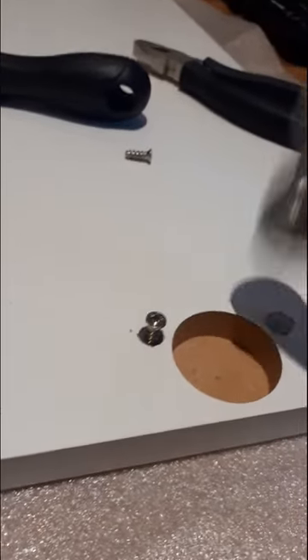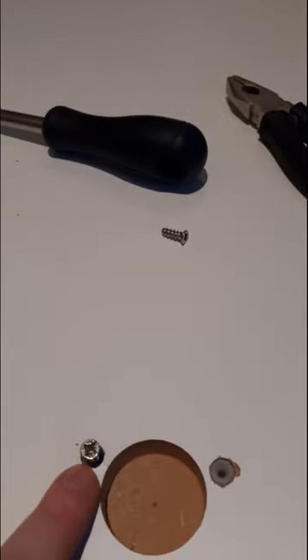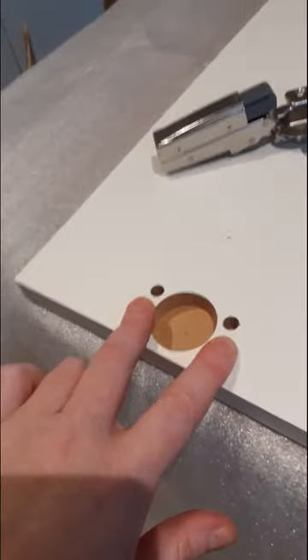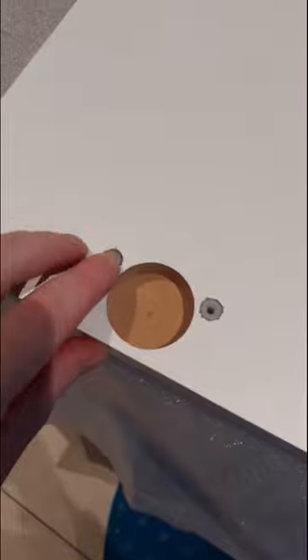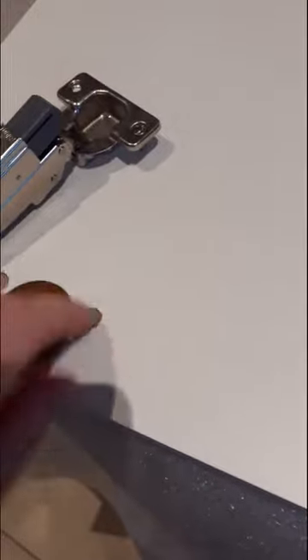So it goes in just under halfway. Perfect - there it is in. So that's what I'm going to do for these two holes and probably all of the other doors in my kitchen. Now my dowels are in and I can put the hinge on. Don't worry if your dowels are not flush with the surface because there is a bit of a recess underneath the hinge anyway, especially because the old ones had a kind of a stop.